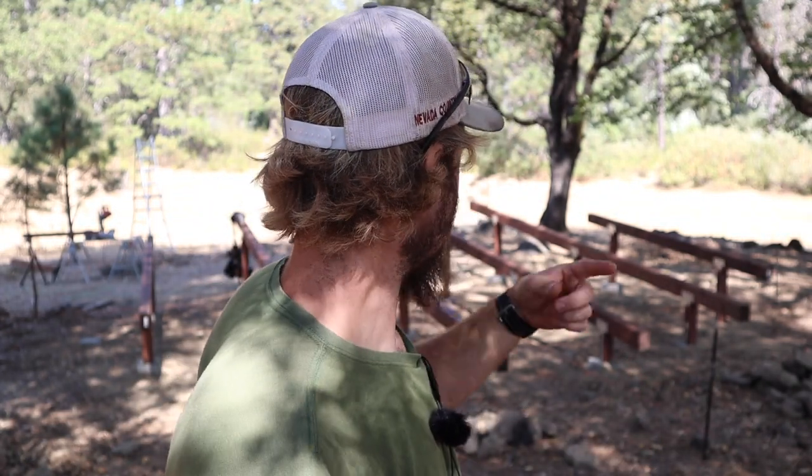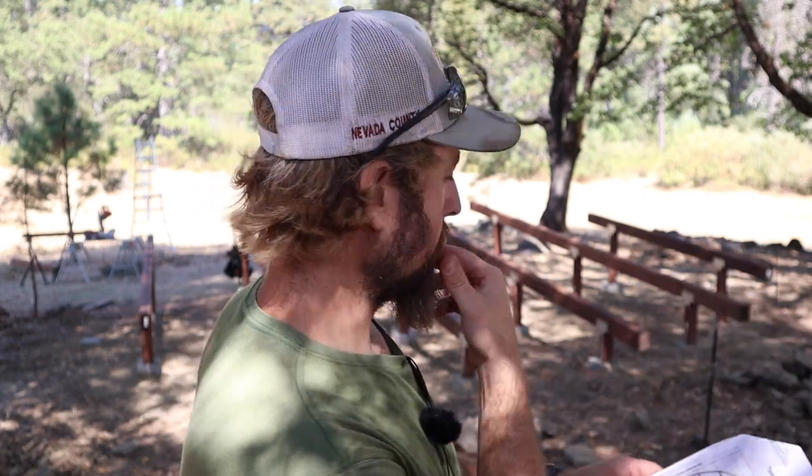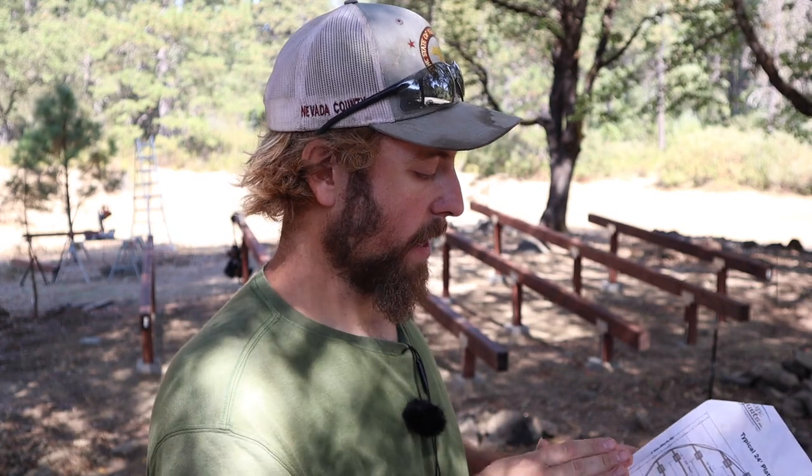Alrighty, so as you can tell from behind me there, I got the girders up. This is a little different than a typical deck structure, because usually you would put joists on top of the girders. But for some reason, and I did get these off of pacificyurts.com is the company. What's different about this structure is I'm gonna put blocking in between the beams or the girders here, and that's what's gonna create my blocking for the plywood to sit on. We are using 1 1/8 plywood. So, next up, let's get some blocking going on.